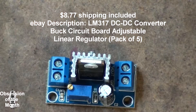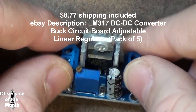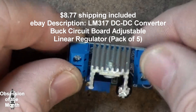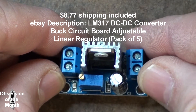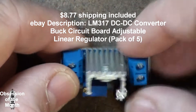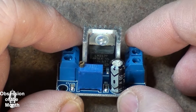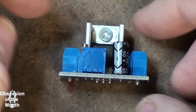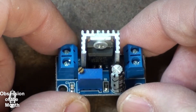One thing I also brought out here is another adjustable voltage regulator that I got off eBay. It's built based on the same chip, the LM317, and it's fully adjustable. However, as you can tell, this thing has a very tiny heat sink. It also does not have any protection built in. If you wanted to make this a little more reliable, you could solder a small SMD diode across the input/output, or really any kind of diode.